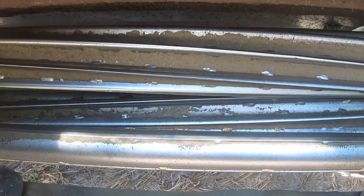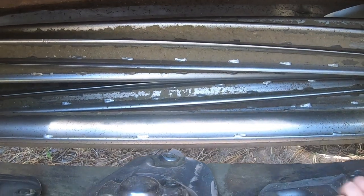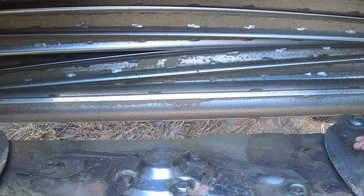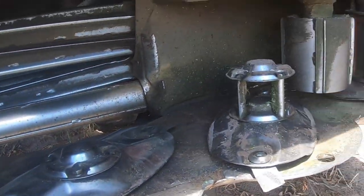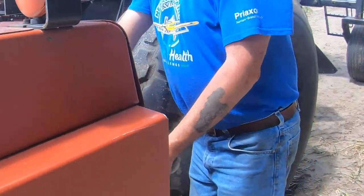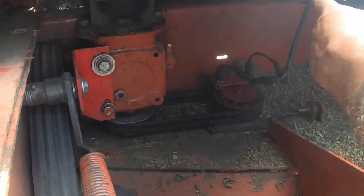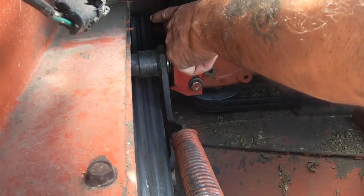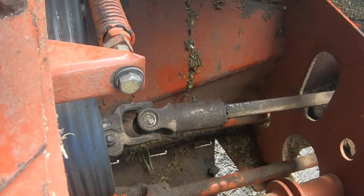As each spin throws the material in, it has a bottom roller to help lift it, and then the material rolls through two sets of crimpers, to condition the crop. The header's driven by two hydraulic motors, one on each side of the head. There's the big hydraulic motor that runs straight down to the cutter bed. This belt here runs the crimper rolls, three shafts for each of the rolls.